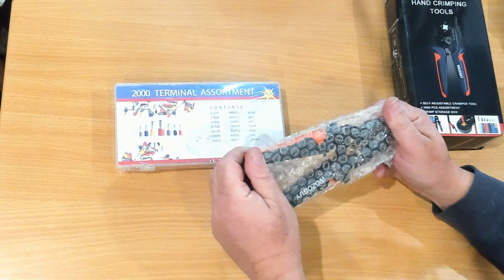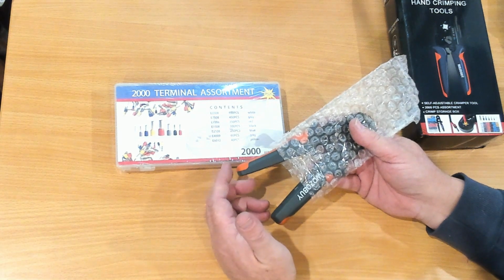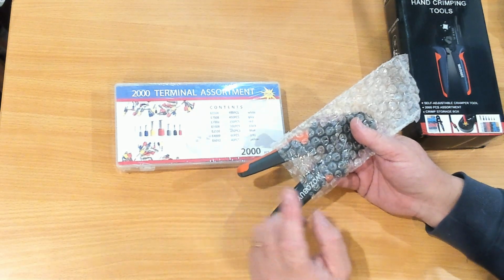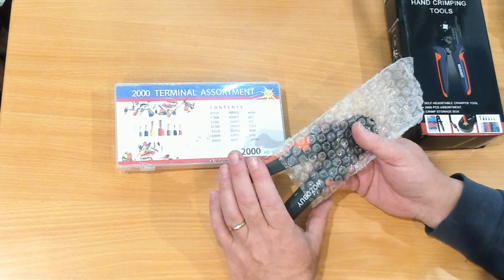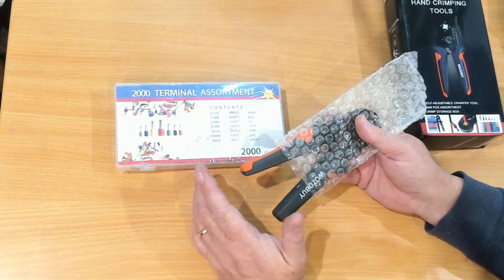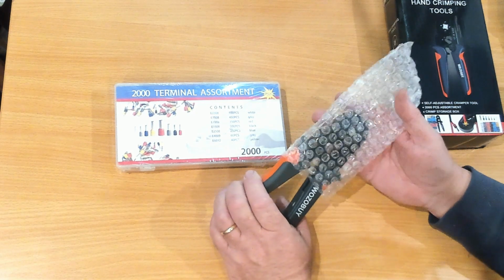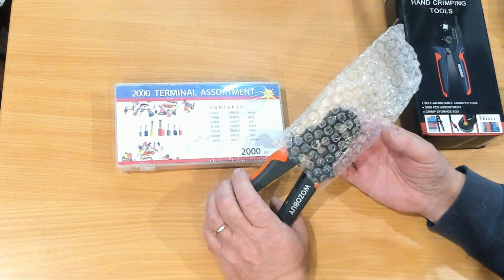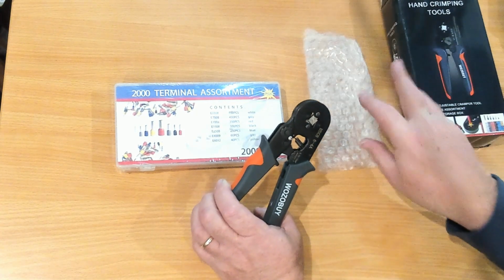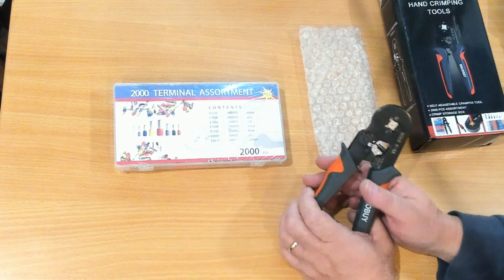With a stranded type cable, if you have a strand break, all of the strands around it will continue to carry the current, and there isn't a lot of resistance around a single broken strand. So it doesn't increase the resistance of the total cable by much. It's only if you break a lot of strands at the same place that it becomes a problem. So you can have multiple broken strands spread out along the length of the wire and it has very little impact, which makes them more durable, and you'll find them used anywhere where there's a lot of vibration.